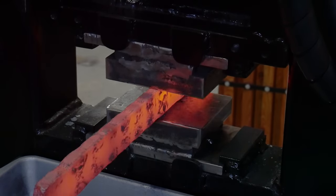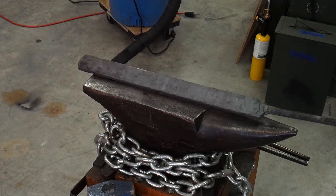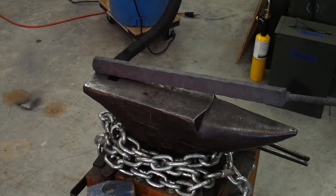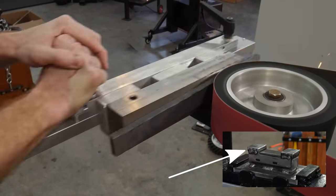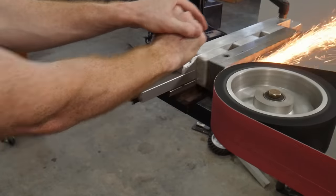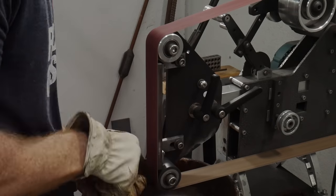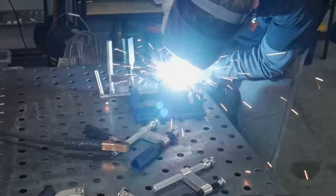There are three things I learned this time around that helped with this issue — one I did well, and two I fell short on. The first thing that helped me conserve steel was using kiss blocks. I found that ending each drawing-out cycle with a very flat and uniform billet paid dividends in the cleanup process, greatly reducing the amount of grinding needed.